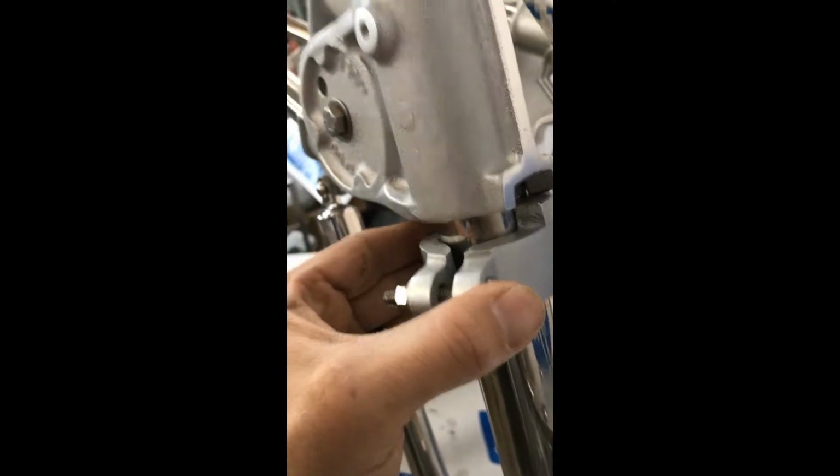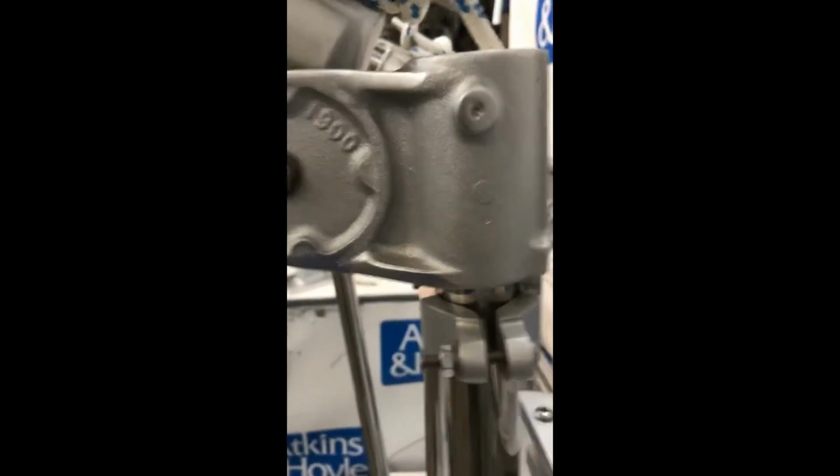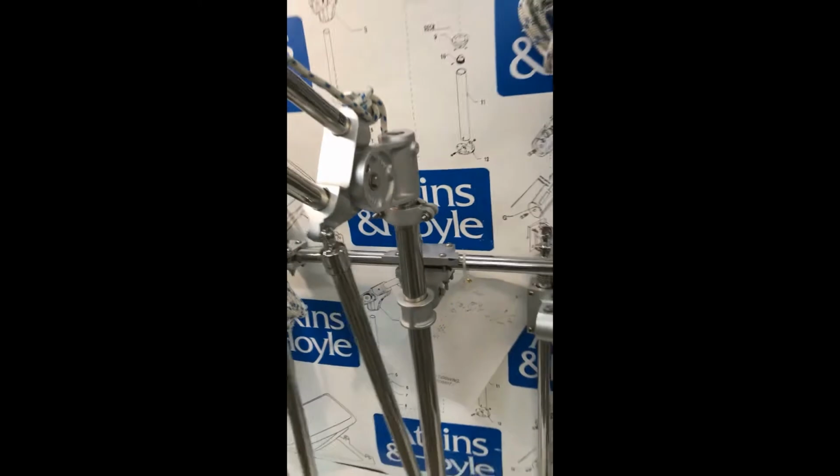The locking collar is unique to the Model 1400 and Model 1900 rotating davits. Align the keyway type castings during installation to stop the davits from rotating when the dinghy isn't connected to them.